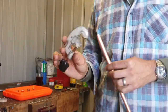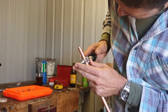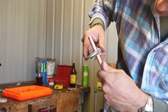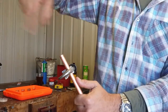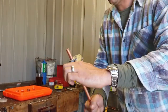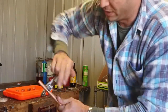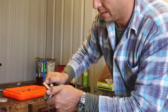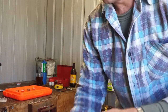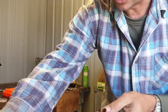If you've never cut a copper pipe, this is a pipe cutter. I've got my mark there at 52mm. So you bring that down, get that onto the mark, and just nip that up until you're happy. I'll just give that a light twist around — I want to keep that on the same cut so it doesn't thread. Then just wind that around one or two times, adding a little bit more pressure each time. You'll feel it start to loosen up and get easier to cut. There we go — pipe's cut. And you just place the reamer part on the pipe cutter to the inside to take those little bits of burr out. That's how you use a pipe cutter to cut pipe.